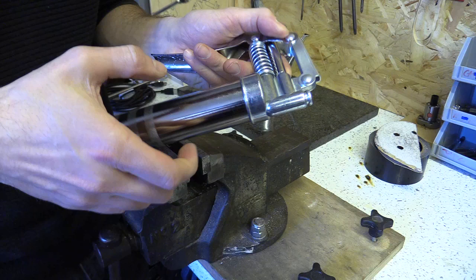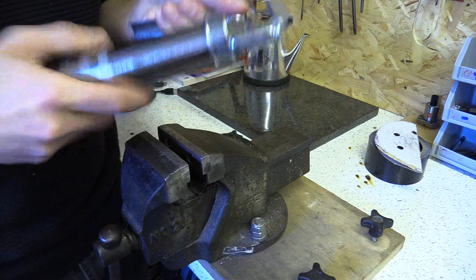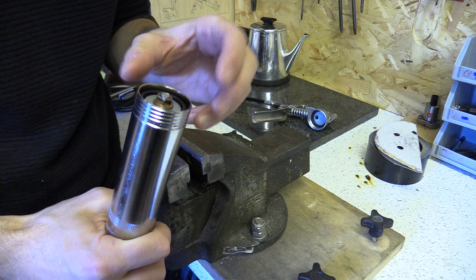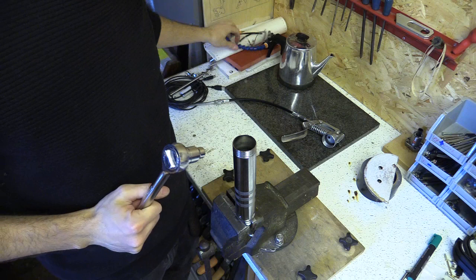Packing grease into a gun is a bit of an art which isn't really shared. I made a complete mess of one grease gun which I tried to pack without a cartridge, and this led me to think that with the cheap grease guns at least you really need the additional thickness of the cartridge wall to provide sufficient compression to the plunger. Or possibly I may have to turn the plunger upside down, but that feels like a lot of design consideration for £11.99. I'll clamp that on and put a pair of goggles on because there is a spring in there.